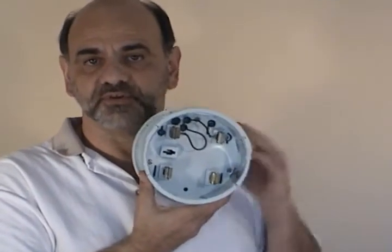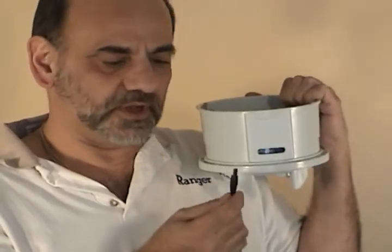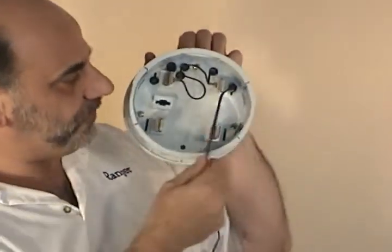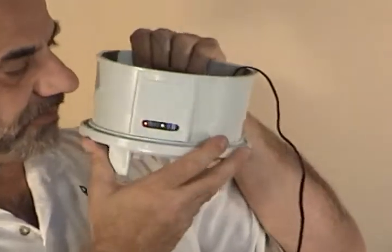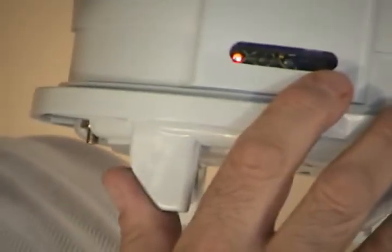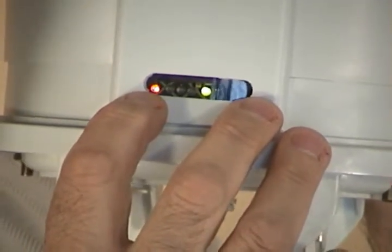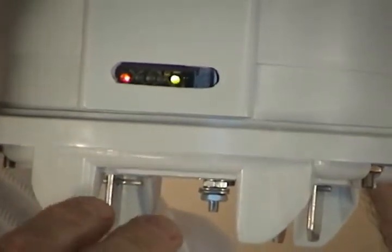The 0 to 200 amps is always in place. There are no set points on the current channels. Now I'm going to plug in the wall charger into the unit — that plugs in right over here. This is what you would do if you were normally going to be downloading the unit at your desk. I want to give you an idea of what this LED array — the COM array down here — is like. These LEDs will blink at different rates and different colors. They're a dual color green and red LED, and depending on whether they're green or red, there's an intelligence about it. There's a listing in the manual that will let you know what a certain type of flash means.